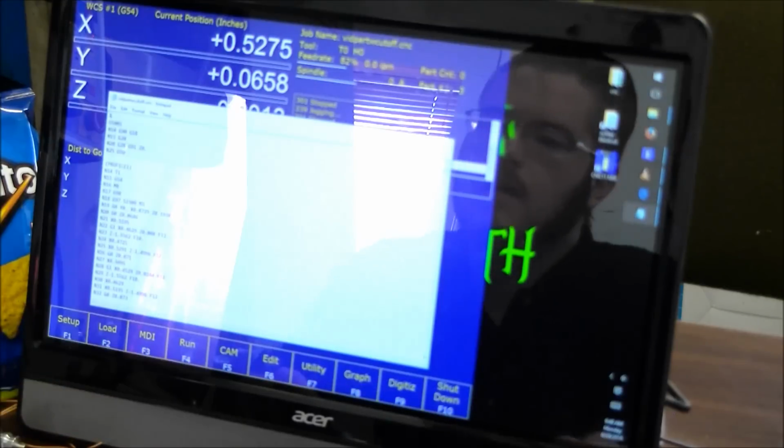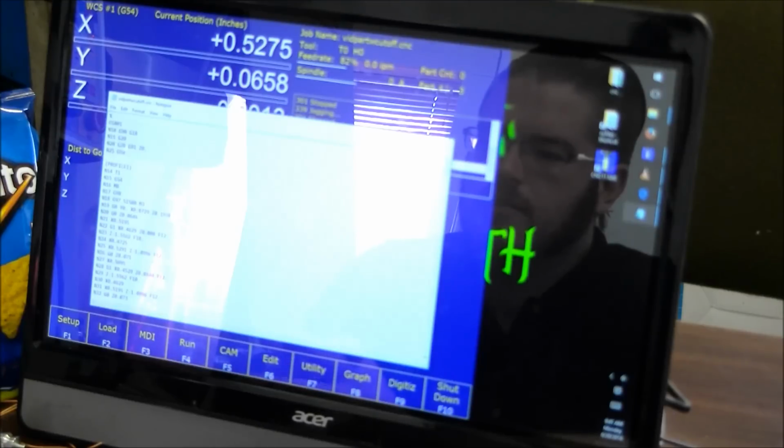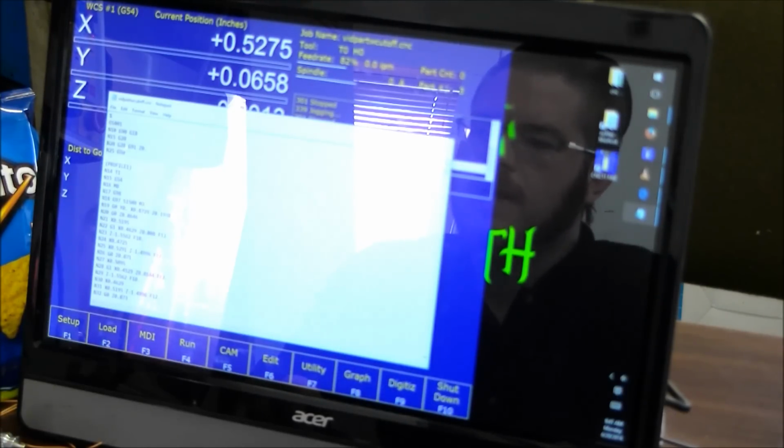Now we go here, and we have the first code I already edited here. The simplest way is the header. Now, lathe post-processing is going to have a different header than a mill post-processor. One key being that mills are going to want to zero to home the Z-axis, so raise the spindle up and out of the way, or if it's the case of lowering the table down and out of the way, regardless of what it is, you are going to want the spindle to be clear of the vise and everything right at the beginning of the job. So what I do is remove the lathe post-processor header and cut and paste a mill header in its place. So you have G90.